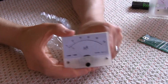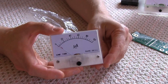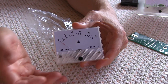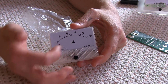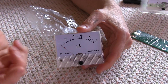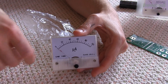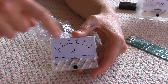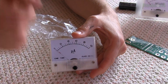You could leave it as-is and deal in metric time — I had a chemistry teacher in high school who had a metric clock — but everyone will hate you. The common way to deal with this is to pull out the metal face, which is retained by two screws. Then I like to just print out a new design on an inkjet printer — I provide templates for this — maybe with your own font, however you want to do it. Cut it out with a pen knife, use a glue stick on the metal face, glue the printed paper to it, insert it back into the meter, tighten down the two screws, and you're done. Every once in a while the paper isn't completely flat and the needle rubs against it, but you just pull it out, push it down a bit, and everything's fine.